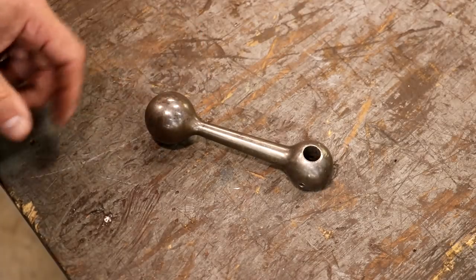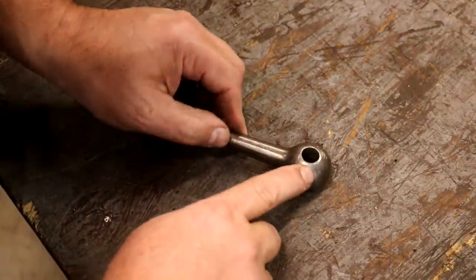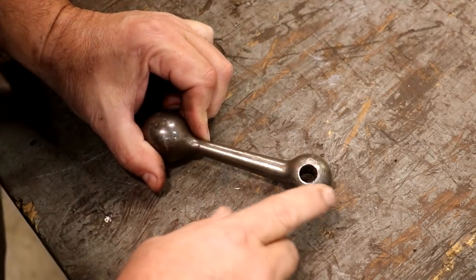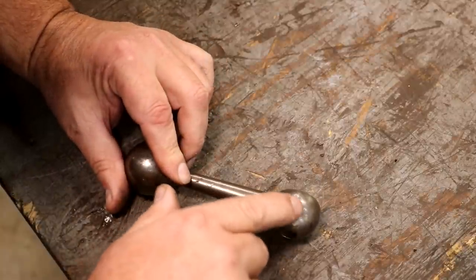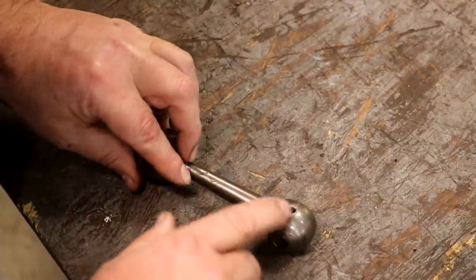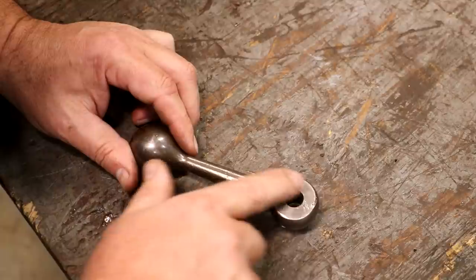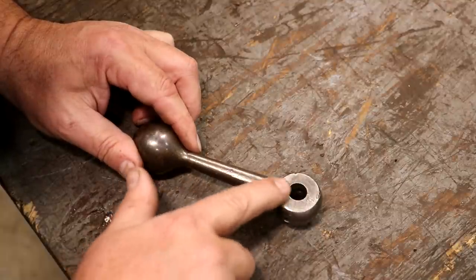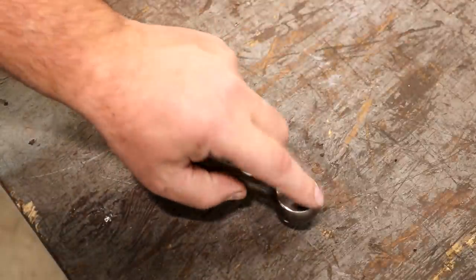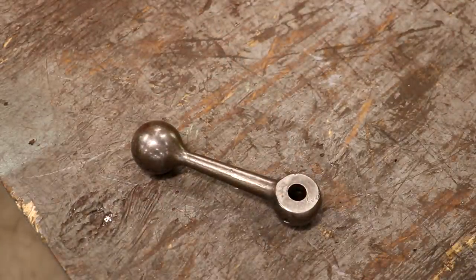Let me give you a quick close-up. You can see where it looks like it's been hammered on up here around the front — looks like someone drove this on with a hammer at some point and beat on the top of it. Also around these tapered pin holes it looks like it's been beat on — that's not round. And on this side here, just some dings where it's not as smooth as it should be. This is a surface that will go up against another surface, so I want to get all of that off. There are some fairly large dings, so I'm going to start with just a file and then probably go to a stone after that.